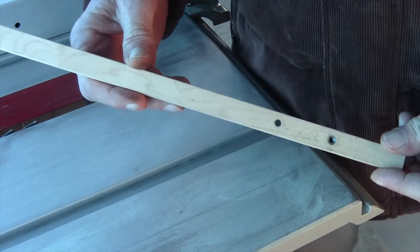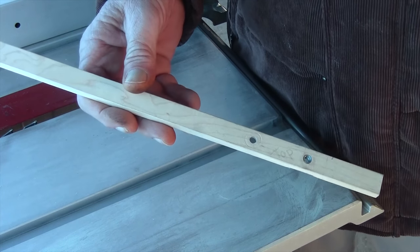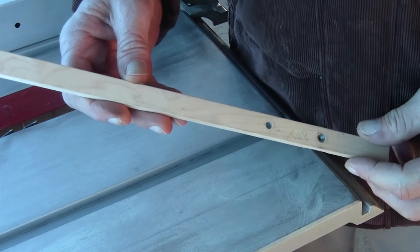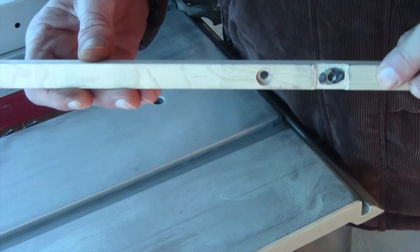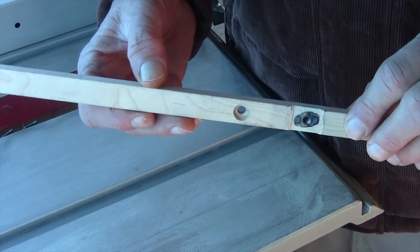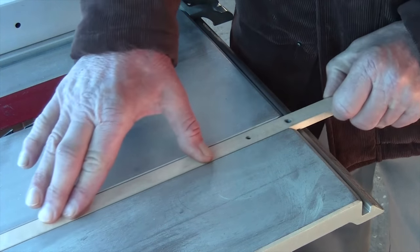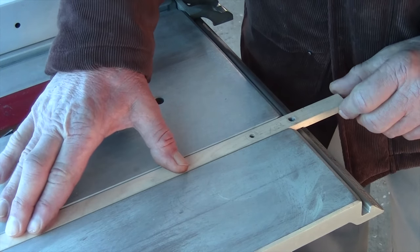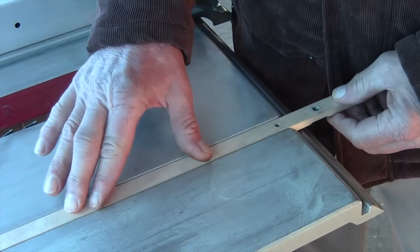First thing I did was I got a piece of hard maple or oak. You want to use a hardwood, so oak is pretty easy to find. What I did was I cut this out on the table saw a little bigger than it has to be, and I sent it through the planer taking off a thousandth of an inch at a time until it fit in here. You want it to move nicely but not go back and forth. Just keep sending it through your planer until you get a perfect fit.